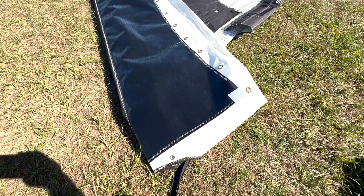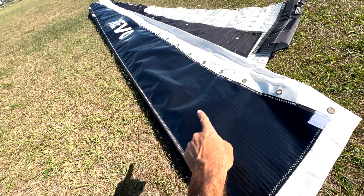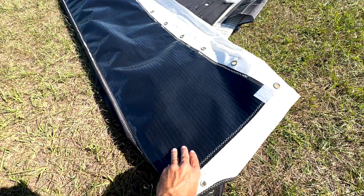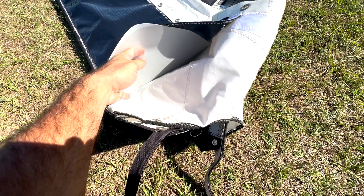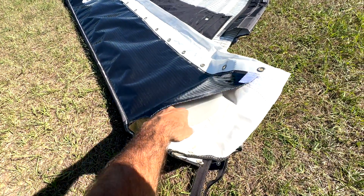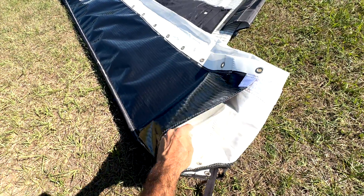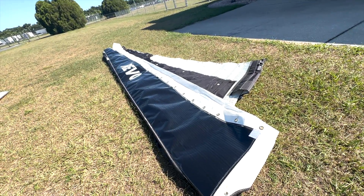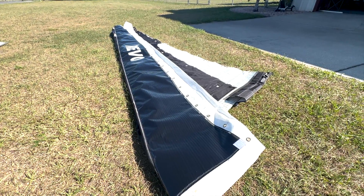This side we've already done. A lot of people think that this tri-lam on the outside leading edge is structural — it's really not. What it's doing is it creates an envelope. This white material, this Dacron here, this 6-ounce Dacron, that is the structure behind this leading edge. And then that envelope holds this mylar, which is a very thin piece of plastic, and that helps to give us the shape and hold up to the wind when we're flying so we don't have deformation between the ribs.